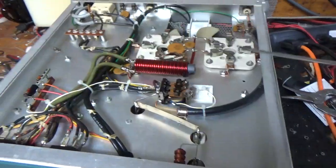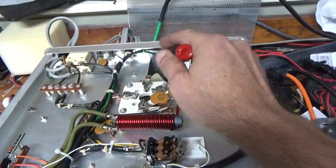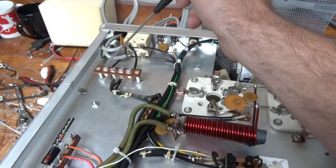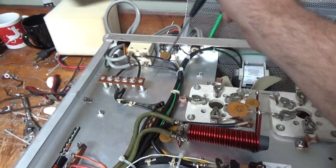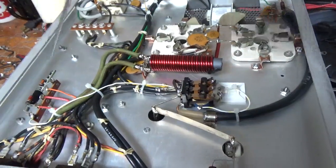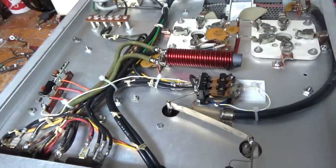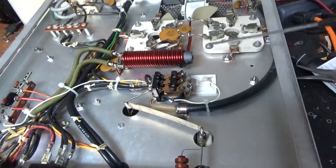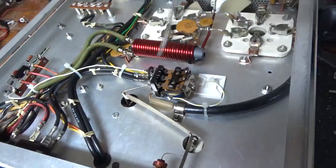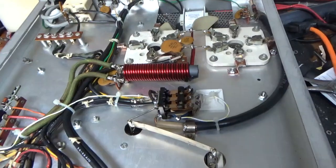Here's the bottom. I changed the electrolytic cap and grounded the grids. I soldered and heat-shrunk the wire for the new fan motor. Checked the SO239 connectors. The amp was wired for 120V but didn't have the proper gauge wire for one of the jumpers, so I replaced both with number 14 solid copper. I ran a new wire over to the coil of the relay — Teflon, silver-plated stranded center conductor. Cleaned the T/R and bias relay with Deoxit Gold. I also secured the wiring so it's not flapping around, routing it on this side so it stays further away from the RF output.